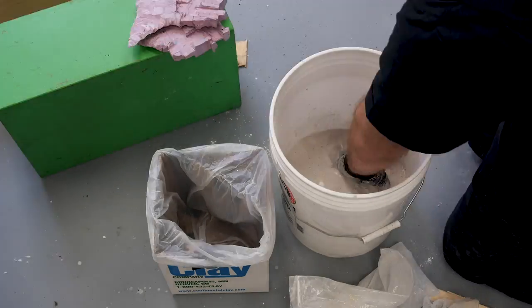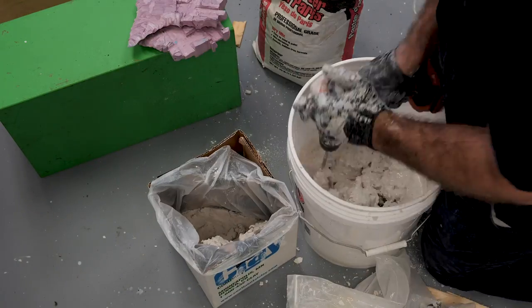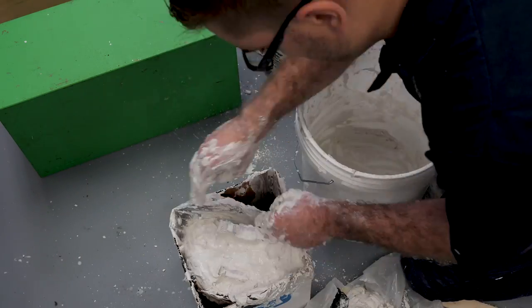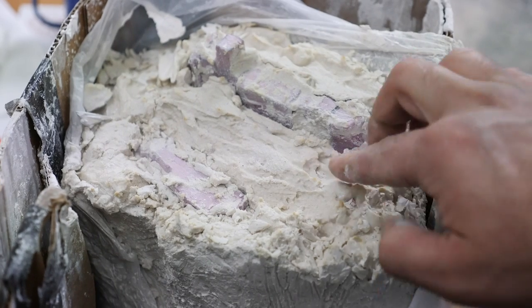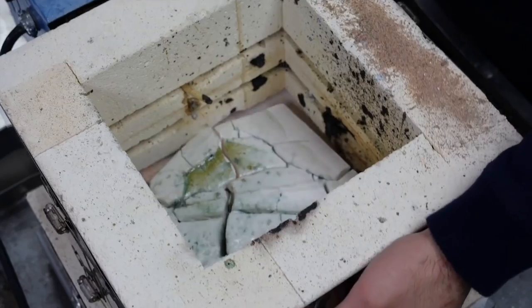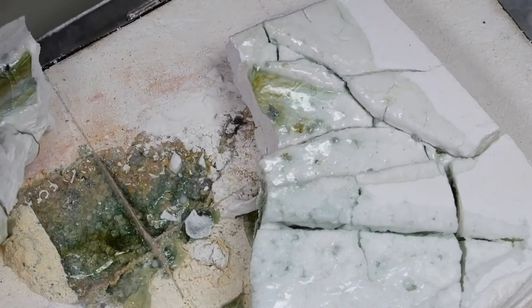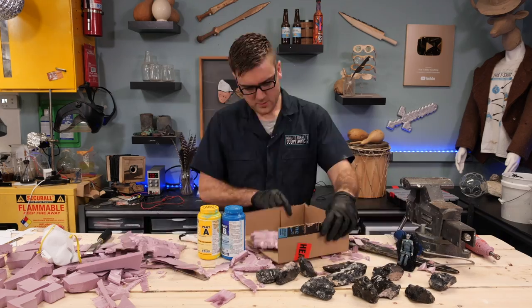So I set up a plaster mold using my foam heads I had carved. Unfortunately, I did a pretty horrible job on the mold as the plaster started to harden on me before I could get everything set, which caused some nasty cracks that are going to be problematic. I also was finding it difficult to get everything to fit inside the kiln with enough plaster around all the parts so that there wasn't any risk of it breaking and leaking out, something I've had happen a few times. I also ended up breaking the foam molds in the process.